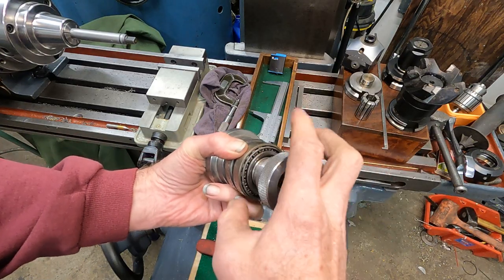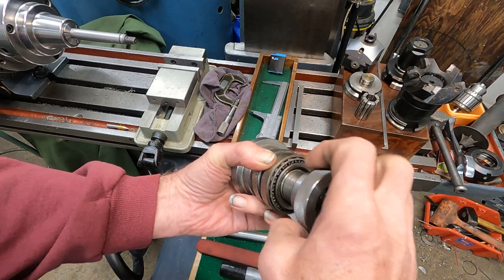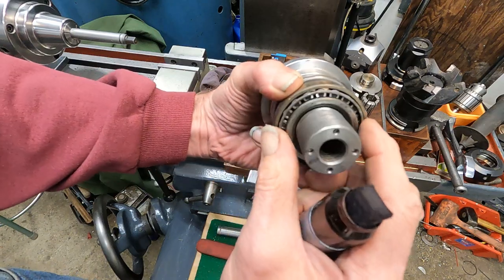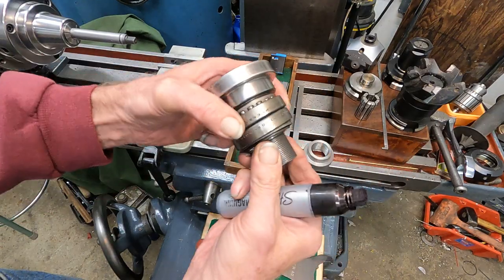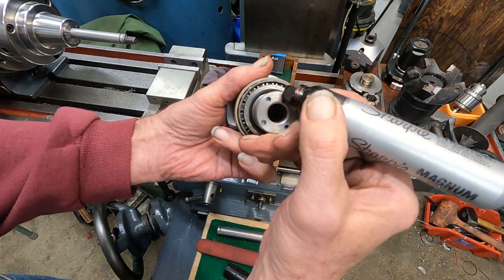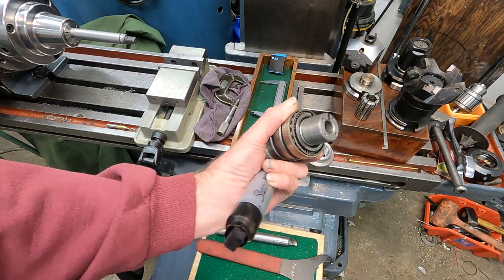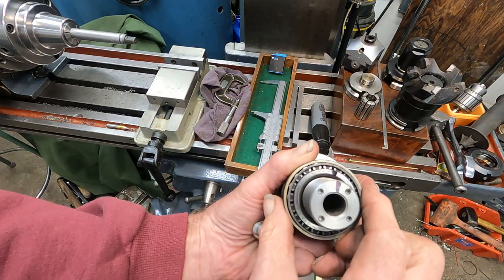This would load at this nut. For any reason, if you have to remove a Timken bearing spindle, this is what you must do: you're going to knock the shaft out of the rear bearing. You'll take and mark this thing — you'll mark the shaft. Then you have to come in and mark the inner race of that back bearing.